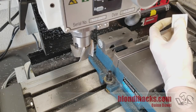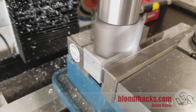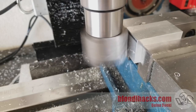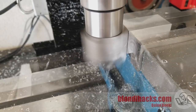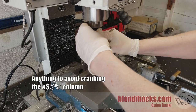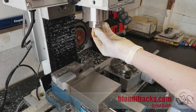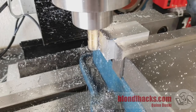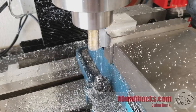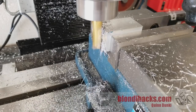We can deburr it and set it up to face our second side. Once again I missed with that parallel, and once again it doesn't matter. This four-flute shell mill does a pretty decent job of side milling, so I'm going to use it to face off the end. Then we go in with a half-inch roughing mill because I should have done one more bandsaw pass on this dimension and need to take a lot of material off — but no problem, the roughing mill makes short work of that. Then we'll go in with a finishing mill to clean up the surface. I really like the long skinny icicle chips that finishing mills make when side milling.